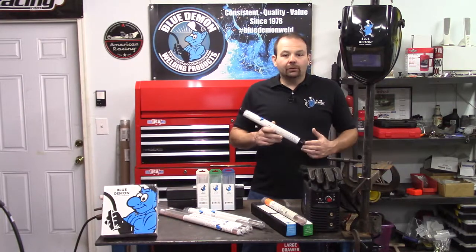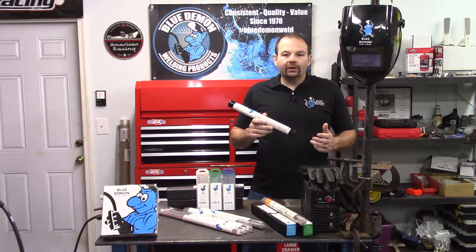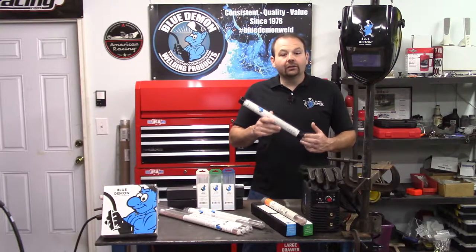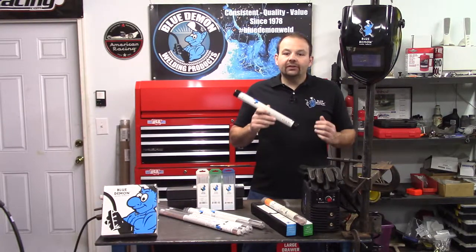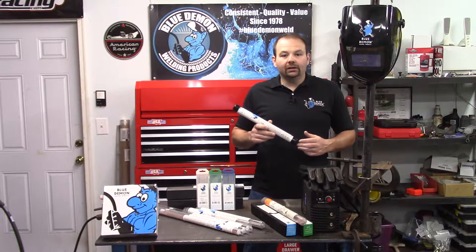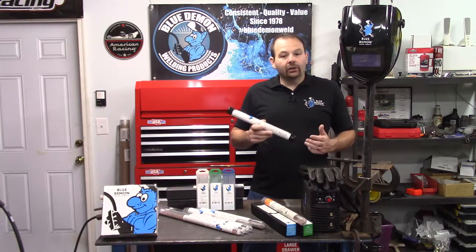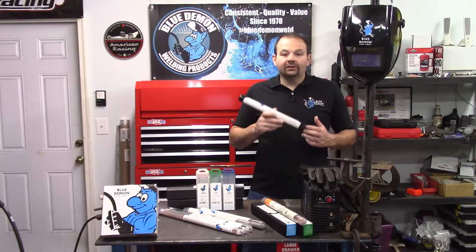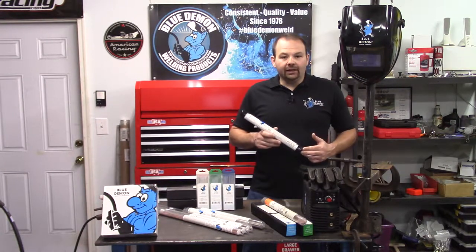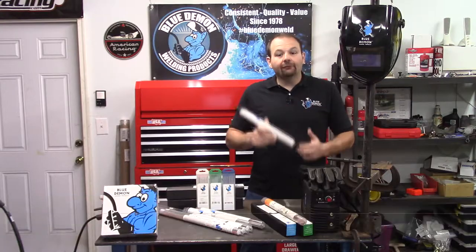4043 is a very popular choice for welding aluminum. It is a general purpose filler metal that has high ductility and high resistance to cracking during the welding process. Because of the silicon additive, it has improved fluidity or wetting action when welding. 4043 comes in sizes 1/8, 3/32, and 5/32. It can weld in the flat and horizontal positions and utilizes DC electrode positive welding polarity. This product can also be used with some brazing applications. Check out Blue Demon's website for more product details and instructions on using E-4043.